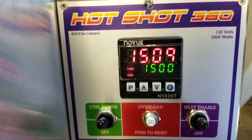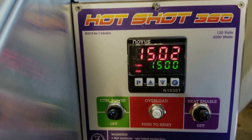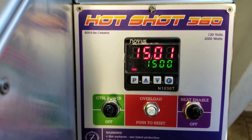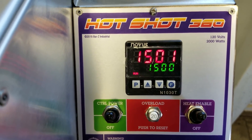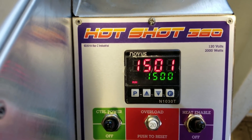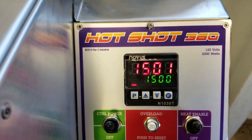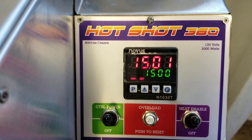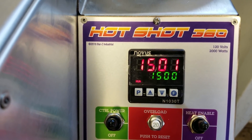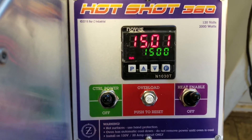We're back and done with our tuning. Watch how stable it is — this thing is pretty much plus two minus zero on stability. The highest number I've seen is 1502 and the lowest is 1500. The oven's running really stable, and even though we're beyond our set point you can see the output just tickling there to maintain the temperature. We've turned a dumb controller into a smart controller.